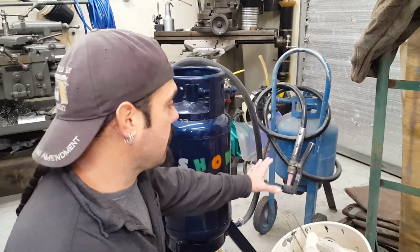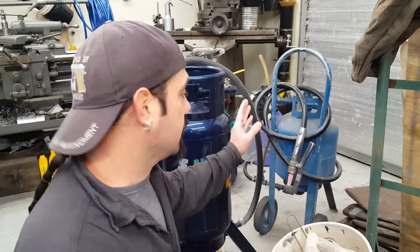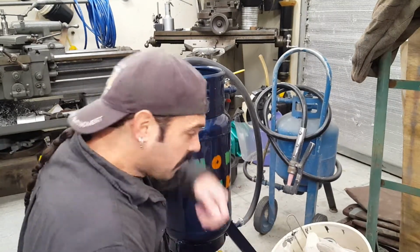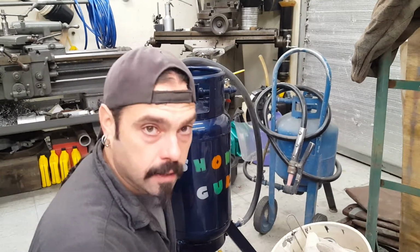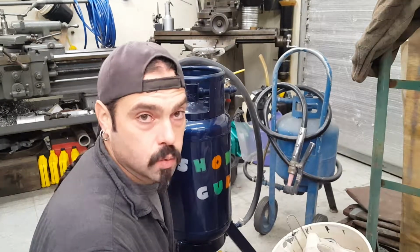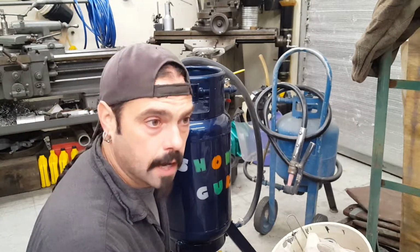Now that little sandblaster, I have sandblasted about 6 or 7 cars from the ground up, inside and out, start to finish, and it works great. Again, the downtime is pretty bad. I've replaced 3 motors on my air compressor because of it. You need to have a really big compressor, not an air tank, a compressor. My compressor runs 17.5 CFMs per hour. So that's a pretty big compressor. It's a twin cylinder, 2-stage. It's only a 60-gallon tank, so the consumption is very, very low on air.